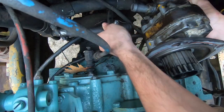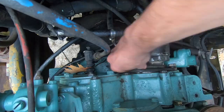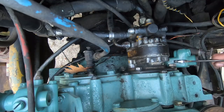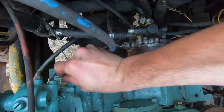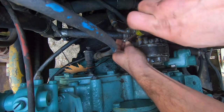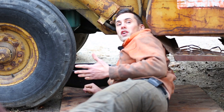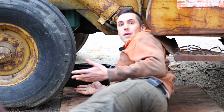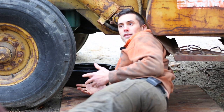The gasket sticks well to the pump, so I can just put this into place, screw the bolts in, tighten them up, and we're good to go. Before I try to start the engine, I'm going to drain the oil out of the crankcase and fill it back up with fresh oil, because the existing oil is contaminated with hydraulic fluid. It's probably not the worst thing to run the engine with hydraulic fluid in the oil, but let's not take any chances.